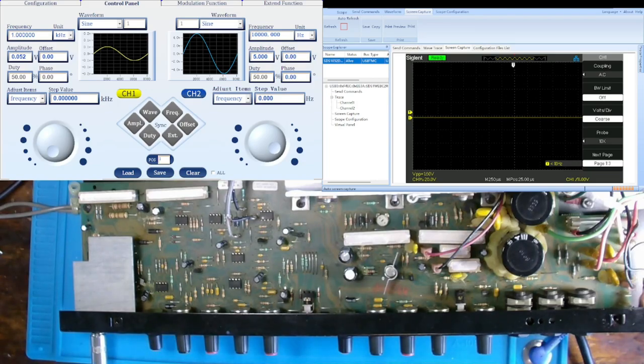So again, I'm going to keep this on 1k hertz at 52 millivolts. And I want you to take note of our O-scope here. Now, I'm not concerned about voltages or anything like that, but I'm slightly increasing the gain, but mostly increasing the level right now. And see how we go into clipping once I increase that gain? Well, let me back off the level a bit.